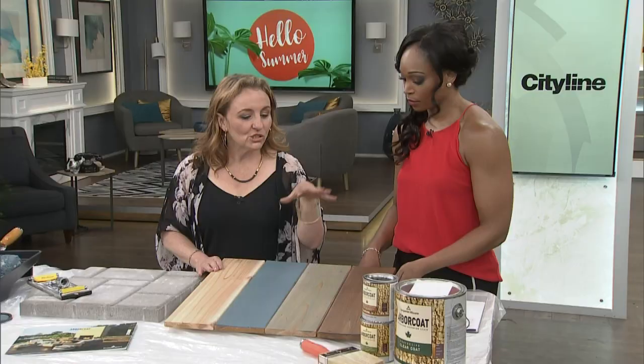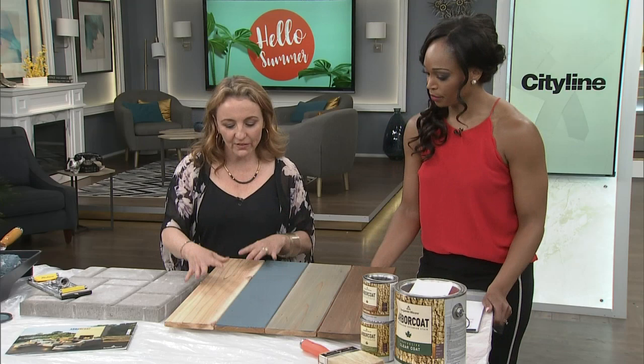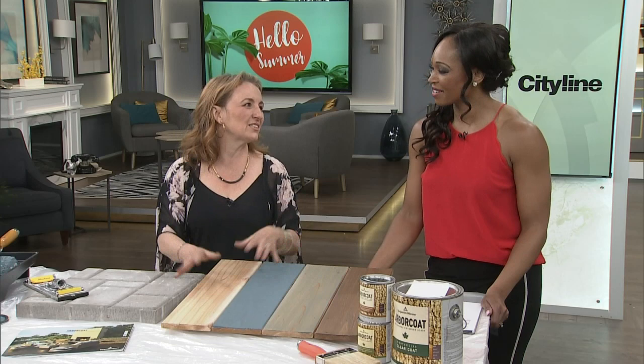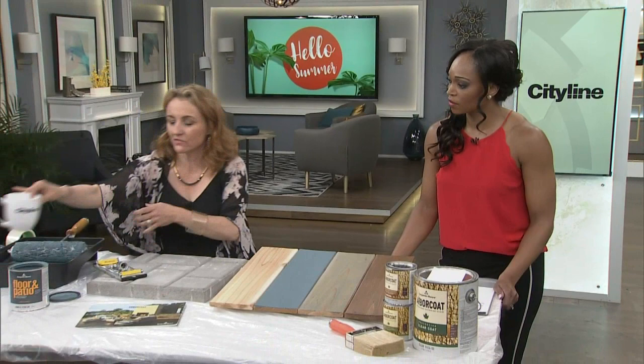These are the three gradations you can deal with. Cedar is beautiful on its own and you might want to leave it that natural color, but it will tend to weather and gray over time. If you've left it out, you may need to give it a good cleaning before staining. Very important: wood needs to be dry before you stain or paint it, because when anything goes wrong with the finish, it's usually the preparation and the substrate.